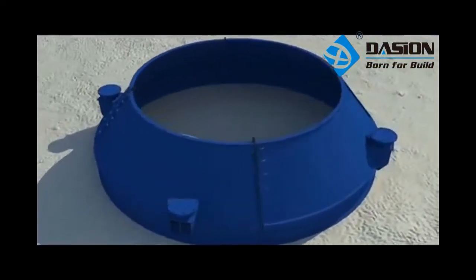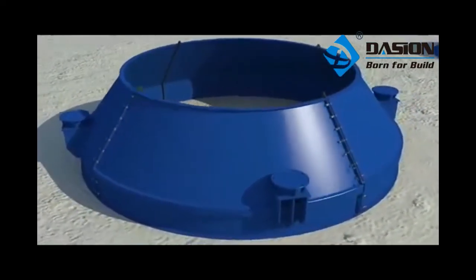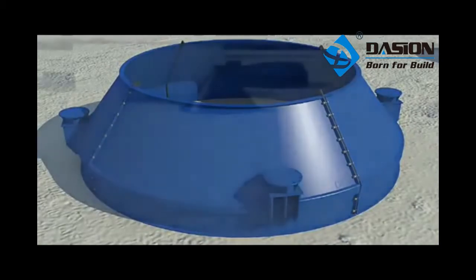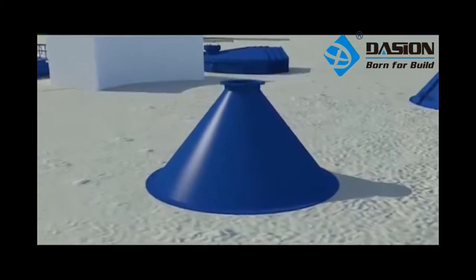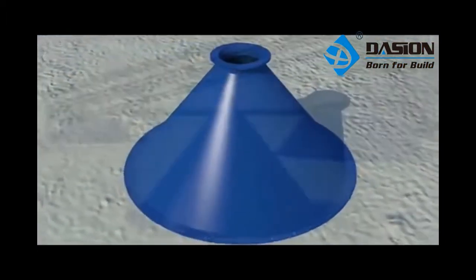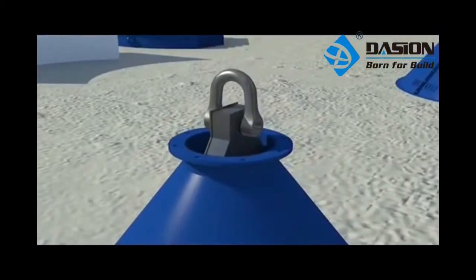4 sheets of large cone are assembled according to the assembly method of middle cone. Small cone is a single welded part, therefore it is not required to assemble by sheet. Properly connect small cone and hoist, tripod, wire rope and fixtures.